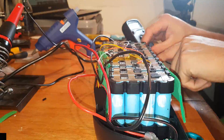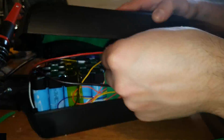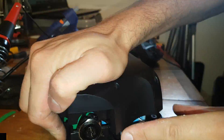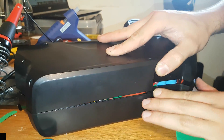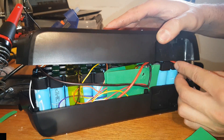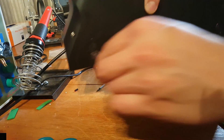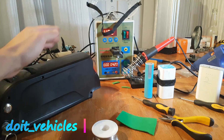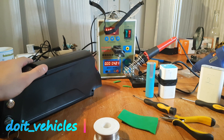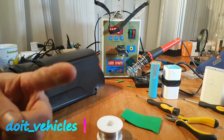If you have space, place a piece of foam on both sides of the battery pack as well as on the bottom. Position the discharge connector on the case correctly, carefully mind all the wires while closing the case, and tie the bolts until both sides close completely. That's how you make an e-bike battery out of power banks! Thanks for watching — if you like this video give it a thumbs up, and until next time take care!